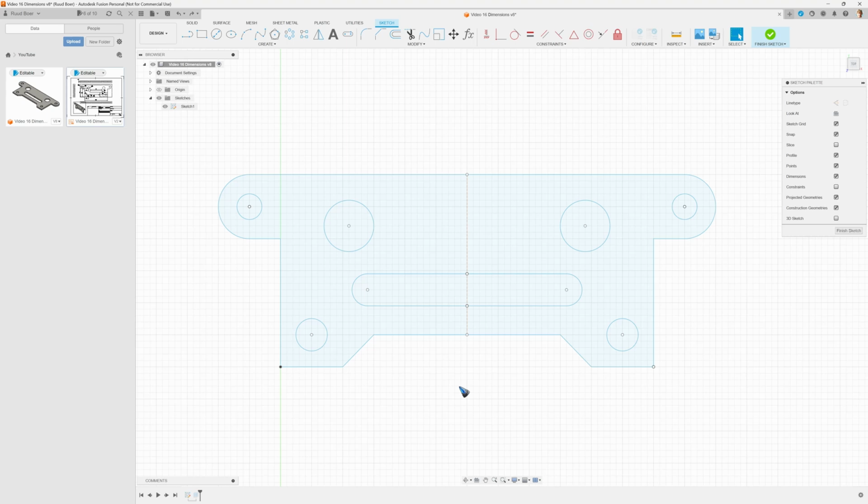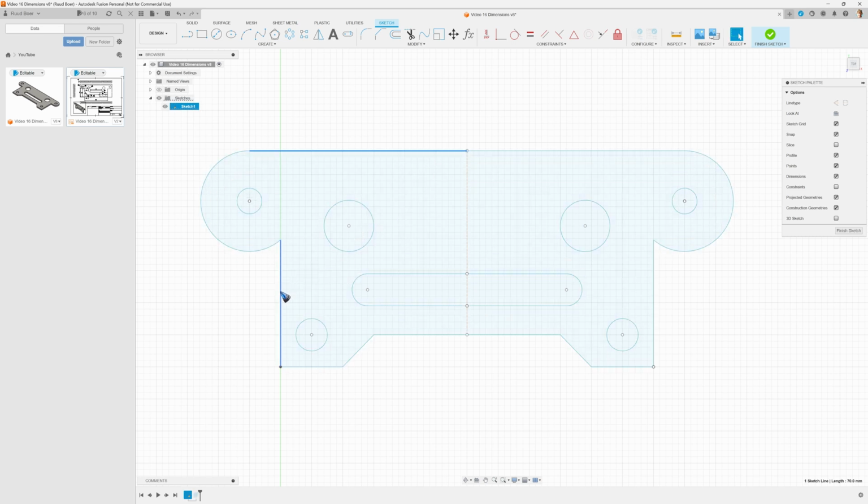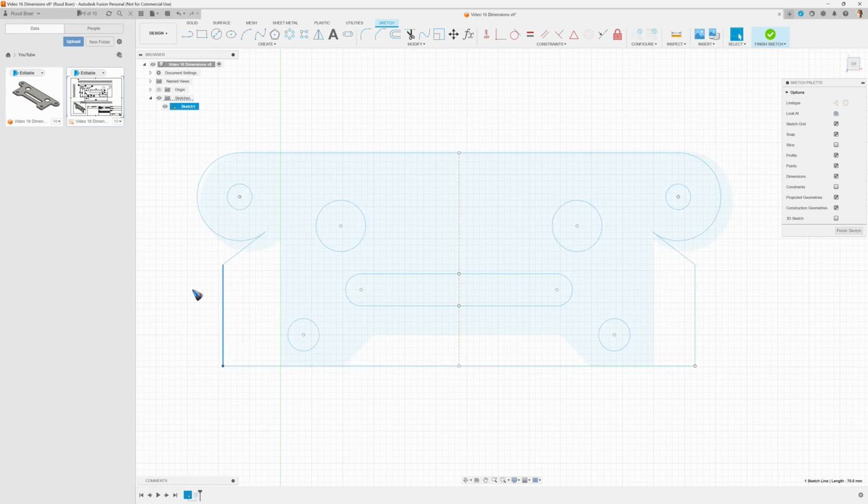So here is this very important part that probably after prototype testing may need some changes. It is totally not dimensioned, but it can be manufactured. Let's have a look. If we try to make a change, it has to become a little bit higher, so I can drag this line up. Oh, that was not what we wanted probably. Also, if we need to make it a little bit wider, oops, that is probably entirely not what we want. These are the kinds of effects you can get with a non-constrained drawing.